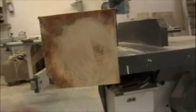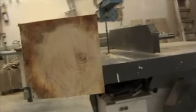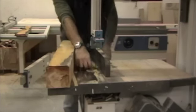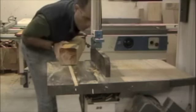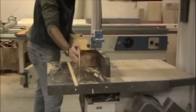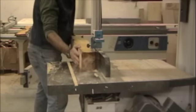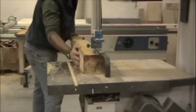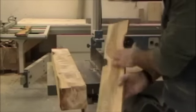Now I'm looking at the end of this log to decide which way to cut — either straight up and down or across. I'll figure out how to maximize the number of boards while avoiding the pith. I'm setting the fence at 7/8 of an inch. I'm going with this thickness because the final project is a jewelry box with a finished thickness of half an inch — so 7/8 is ample rough thickness to allow for air drying and final cleanup and straightening of the board. Here I'm making that first cut, watching my feed rate, and finishing it up. You can see it'll be quite an interesting grain pattern and I'm looking forward to the jewelry box.